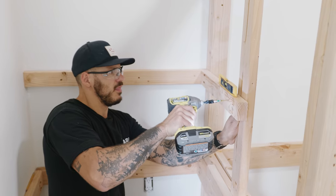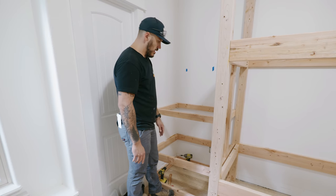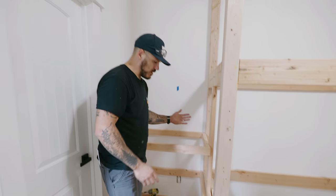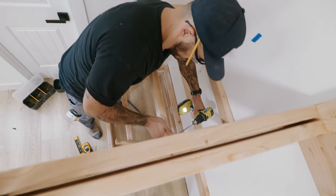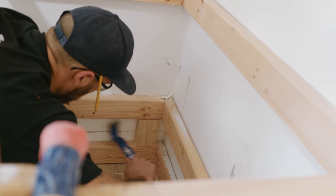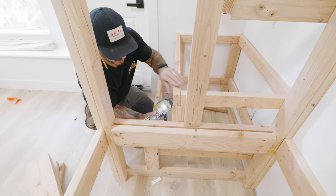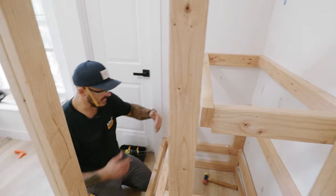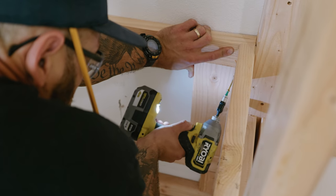We have about an eight-inch run and the steps are about 19 inches tall - we can only do three steps here. The idea is to wrap everything with MDF. These steps are miserable to figure out in the space we have, but I think we finally got something - three of them with a good platform from the top, about seven inches deep. I'm putting a couple of reinforcing brackets along the side and one more reinforcing piece down the middle of each step.